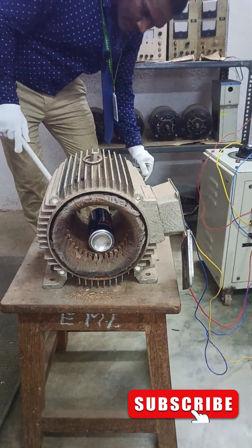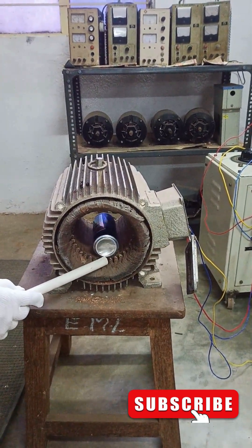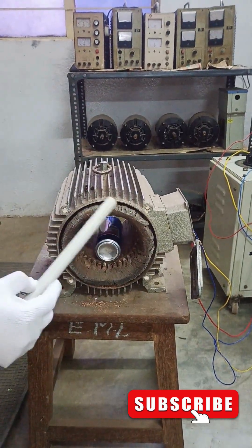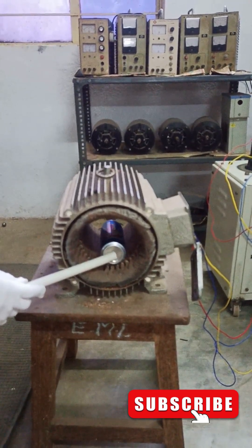Due to this voltage, a three-phase rotating magnetic field is produced, and this is the rotor. You can experience here how the rotating magnetic field produced in the three-phase supply causes the rotor to start rotating slowly. It has some unbalance, so it may come out — we should take care that it does not come out.